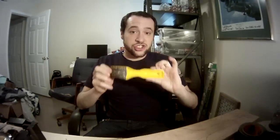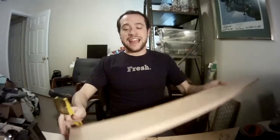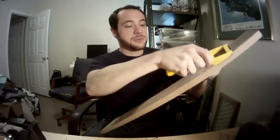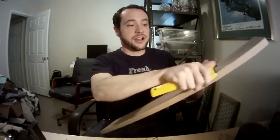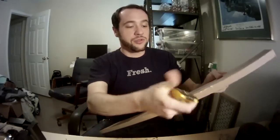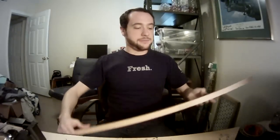You can also pick up a scraper. Scrapers are excellent for taking off hard edges off of your piece — just by simply cutting down the wood length slowly and consistently, it's going to give you a nice rounded smooth edge when you're done with it. We're also going to use this today as part of that shaping technique.